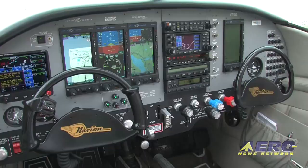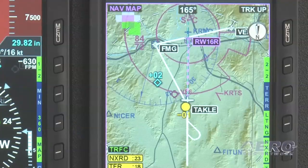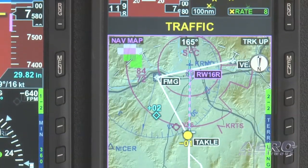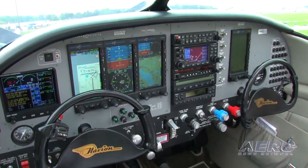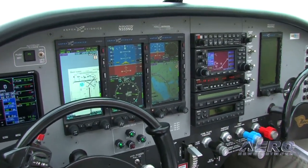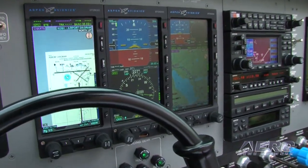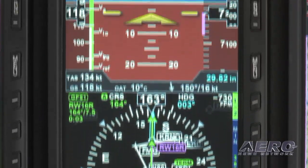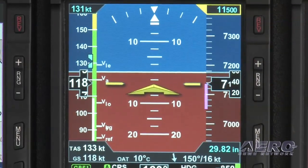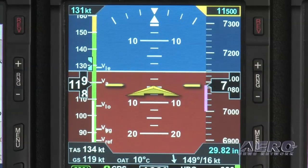How would you evaluate the traffic capabilities? Traffic capabilities are, again, excellent — they are very real. We had that tested in Santa Fe. Locally and around the Santa Fe airport, we had a traffic advisory. I was watching the screen and the co-pilot was watching where the traffic was, and it was dead-on. If we didn't make a maneuver, there could have been a head-on. It's perfect, especially when you get into a congested area. One of the nice things about a three-screen installation is the fact that you can apportion out tasks a lot more selectively. You could have one screen doing one thing, another screen split doing something else. The fourth screen on the co-pilot side, we reversionary'd it to the primary flight display, and the co-pilot was hand-flying it while we were just doing other tasks.